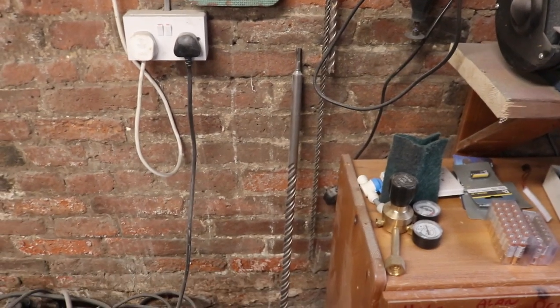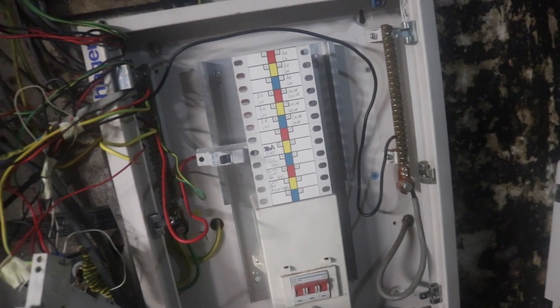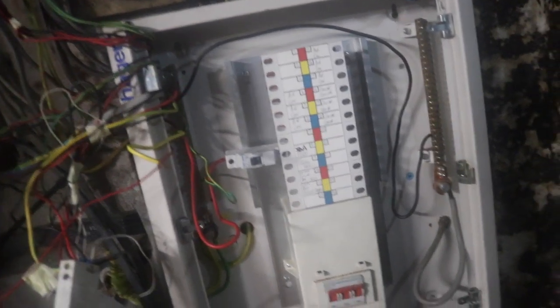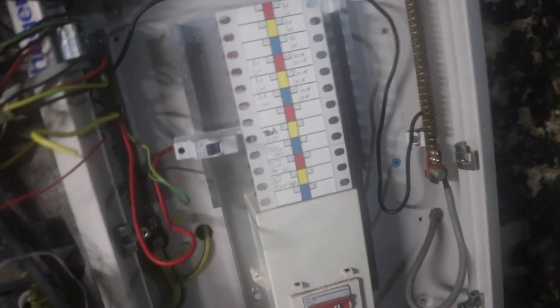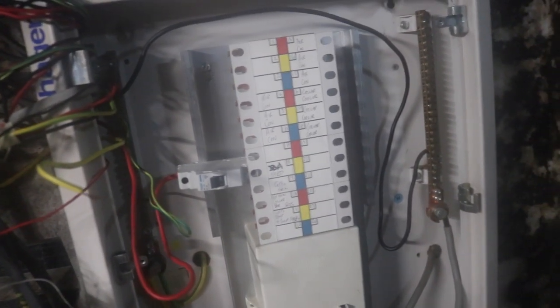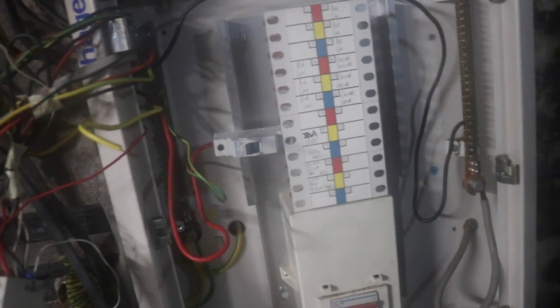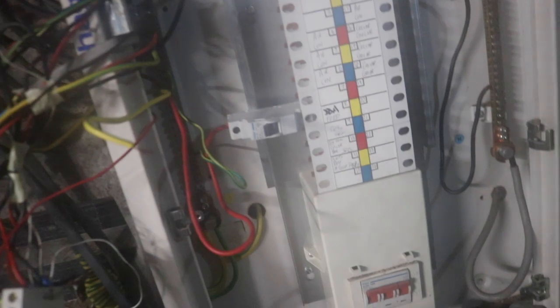We're going to knock a hole in the wall and thread through the power cables. We're in the cellar now — whoever put this electrical consumer unit in left it in an abysmal state; I wouldn't call them an electrician frankly. So I've taken everything off but the lighting circuit and I'm working live with all the correct precautions. We're going to put all these MCBs and RCDs back in, terminated correctly, making sure nothing's overloading any MCB and they're all correctly rated.